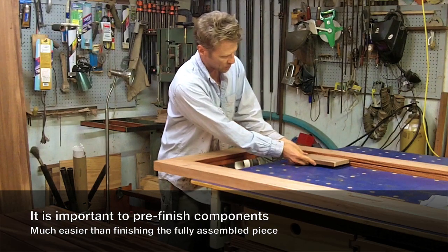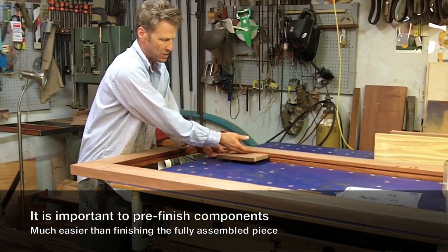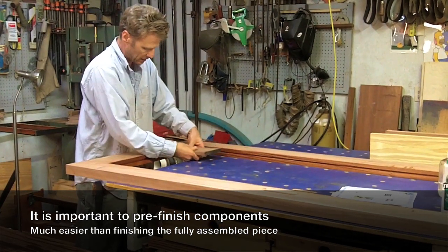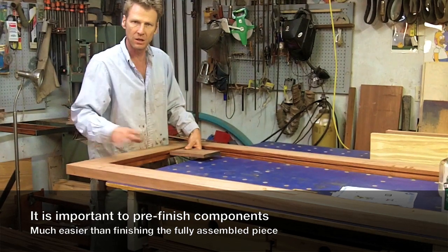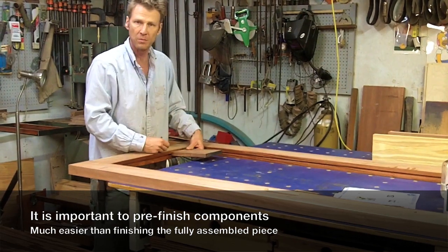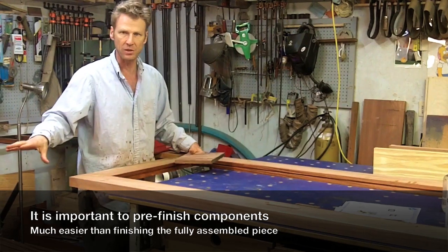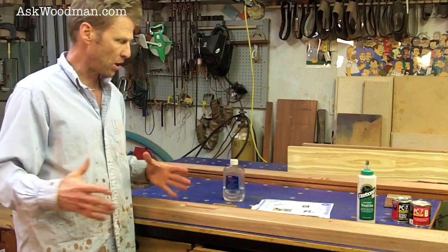You can see that the mahogany panel fits in like this, and it's very difficult to finish into these corners really cleanly and get that beautiful stroke — that absolute perfect finish — like you can when you have free movement across the end of the board. That's why I pre-finished these and now I'm just going to trap them inside this.